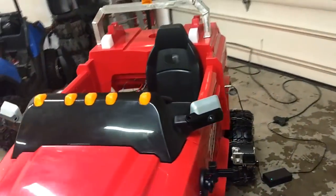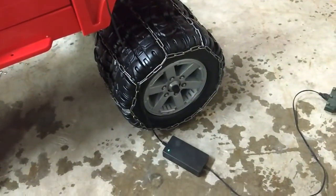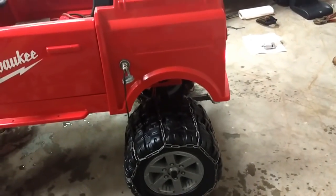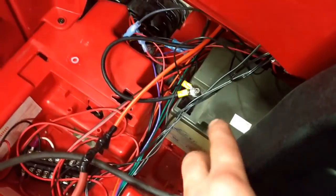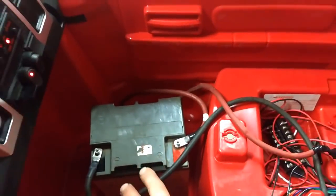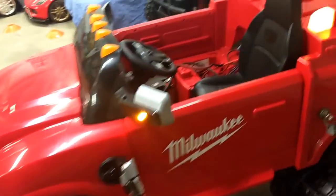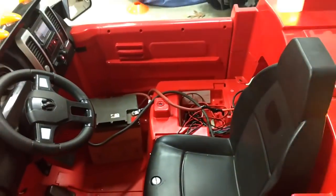You can see the diesel fuel hashtag electric — it's charged up and ready to go. I've slipped in a new 13-tooth gearbox and this thing is ready. What we're going to do is leave the 26 amp hour battery over the rear axle, and the one we have mocked up in here is going to go over the front axle. There's a front bumper support we're going to cut, and we'll build a battery tray right over the axle — that should definitely help with traction and get it out of the way.